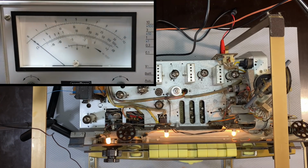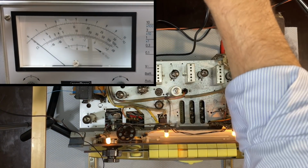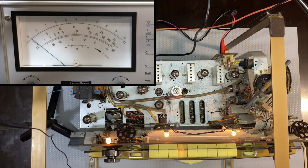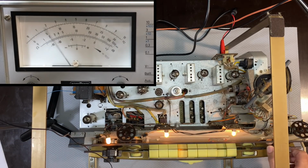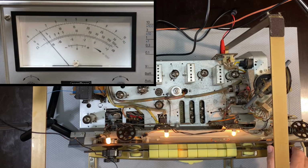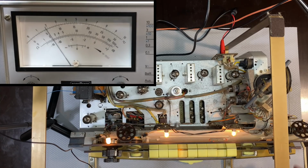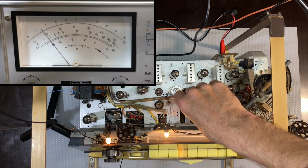Okay, now press the L key, long wave at 190 kilohertz. At 190 kilohertz, adjust 14 and 6 for maximum. So we got to go to 190 kilohertz. See, what we're getting here is noise greater than the signal. And 190. This thing is slap bang 190. I'm not changing anything on here. Maybe the antenna coil, hang on. This one's only got an adjustment at that point.